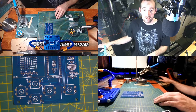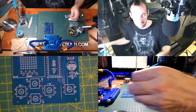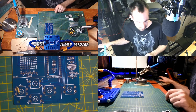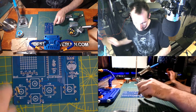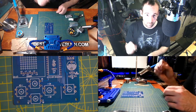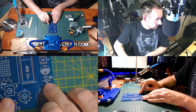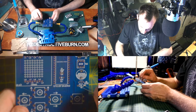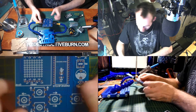Let's go ahead and put this thing together. First thing I like to do is test everything — just make sure that you test your resistors, your capacitors, and all that. But I've already done that, so I'm going to go ahead and put in the 1K resistor right here. Do note there is no direction — just stick it in any way you see fit.